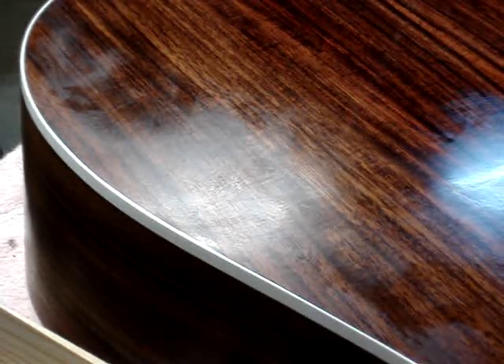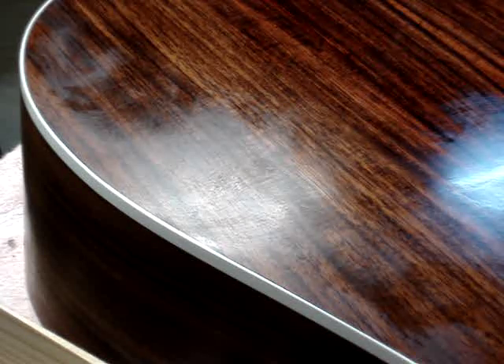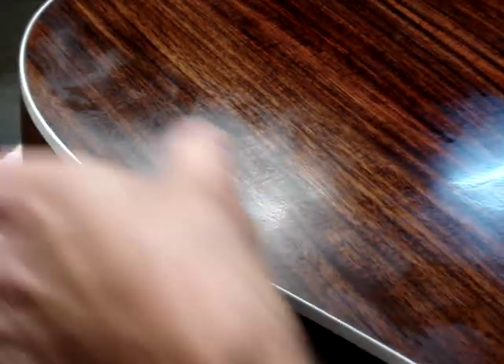Hi, we're back again. I thought I'd show you how I apply some of the polishes. I've already had several coats of the French polish on here. I've wet sanded it back down with olive oil several times. I've got a nice smooth coat as you can see up in here. I've already put some more finish back on. I'm going to show you this area here.